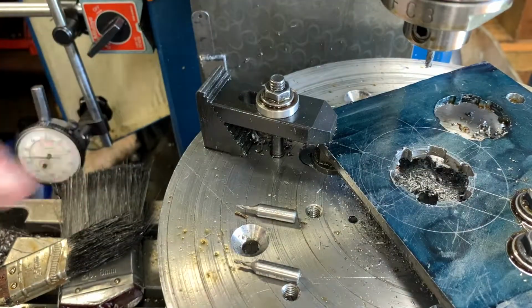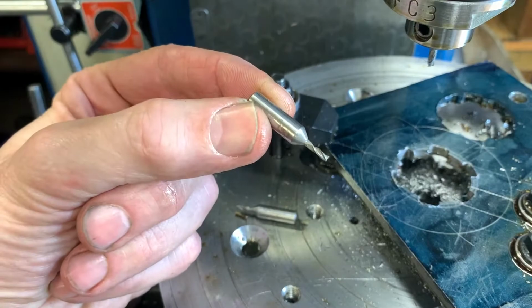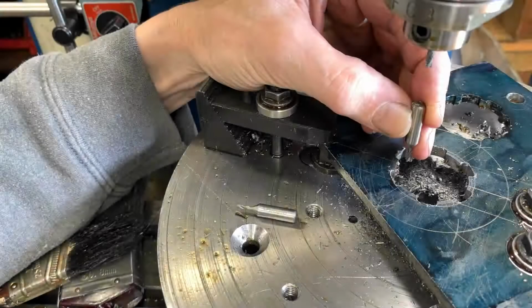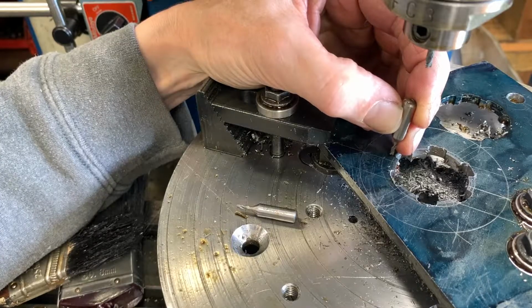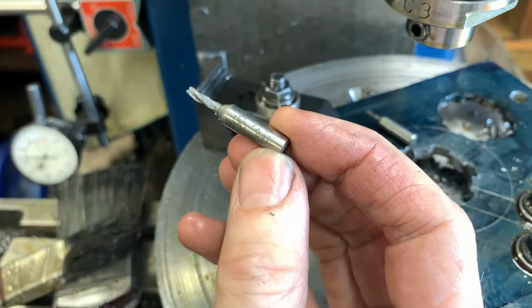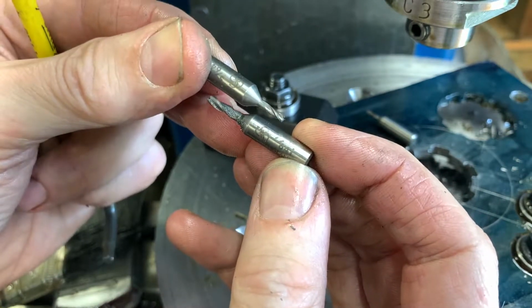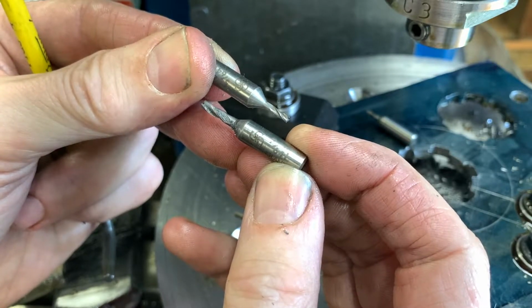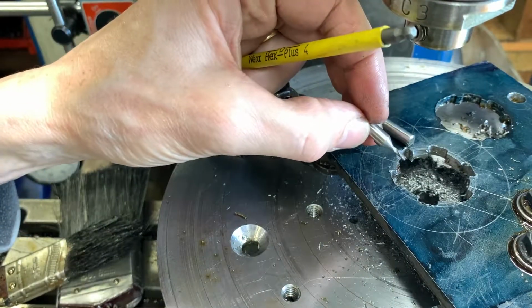We've been using a larger diameter cutter there, so we're going to swap out, go for the small cutter, and then we're going to make our square cuts. So that's your 7/64 coming out. That's the finest one I've got, which is your 5/64. Give it a go. Well, I've got finer, but it's not long enough to clear the thickness of the workpiece.